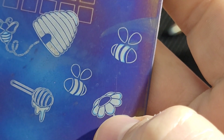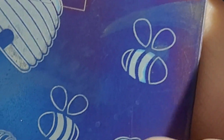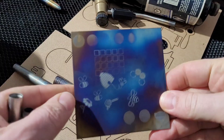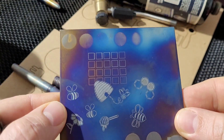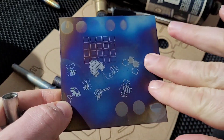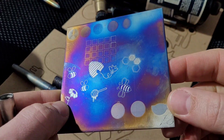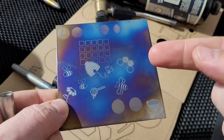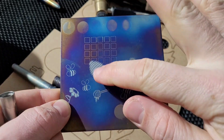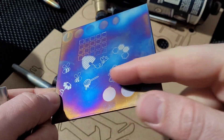You can see it ablates the oxide layer, but there's still some heat, so it gives like some little highlights. So I could do some cool stuff here. I busted out the tripod so we're not wiggling. What I'm thinking of doing is I'm going to anodize a pen. I'm going to play around with the patterns a little bit more and what types of colors I can do. I ordered a power supply so I can accurately control the oxide layer thickness I get on here, so I can do gradients and all sorts of things.